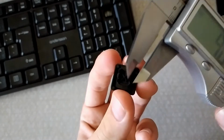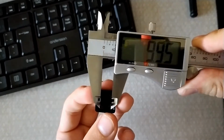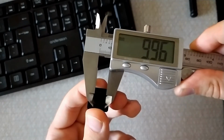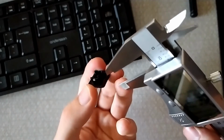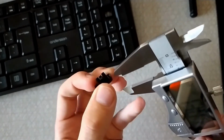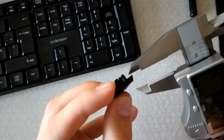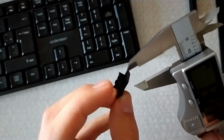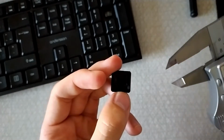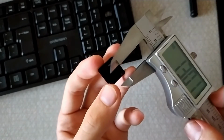So for the actual functional parts here at the bottom, we have this rectangular shaped out-sticking part, which is about 10 millimeters by 10 as well, and when I checked on the keyboard, it doesn't actually have to have these openings, so we can make it actually solid with these small tabs you see right here, clicking it in place, but we can also make some small out-sticking parts right there. They don't have to flex that much, so we don't have to make all of these extra things that will be really hard to print out.